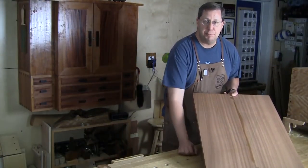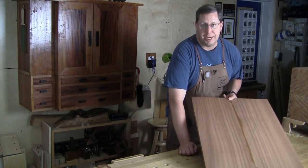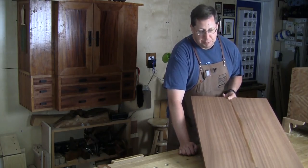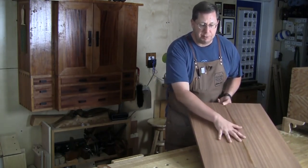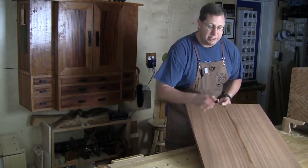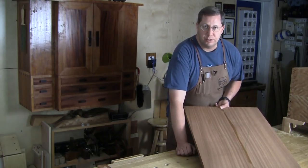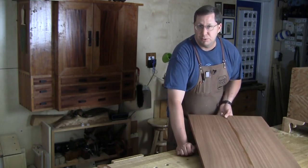Of course, while we're on the topic of this panel, another thing I did this week was release an apprentice session video in the Hand Tool School on what I call my Match Plane 2.0 technique. The matchplaning technique of folding the boards together and planing them all at once to the complementary angle is ancient, but I've tweaked it to purposely create a bevel on the edges, which gives me a little bit wider glue surface and I also think makes the glue-up a lot easier. So Hand Tool School Apprentices, you can look to see that video this week as well.